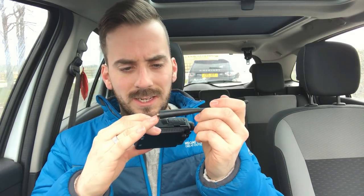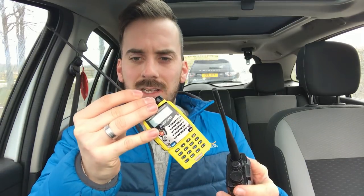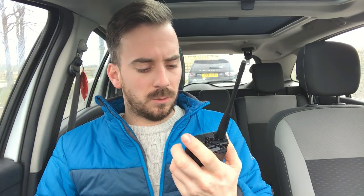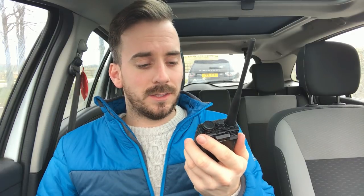Because it's submersible, there's a rubber seal around the antenna base, and the SMA connector is actually longer than usual antennas to accommodate for this rubber seal. So it would be difficult to properly swap out the antenna — as you can see, the antenna that fits all my other handhelds wouldn't fit this properly. I have opened the repeater 75 miles away on half a watt from here, and putting out five and a half watts on this it won't open it and can't hear it either.